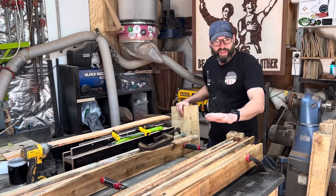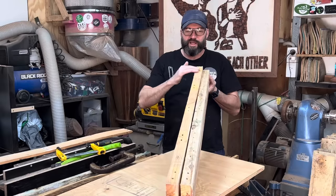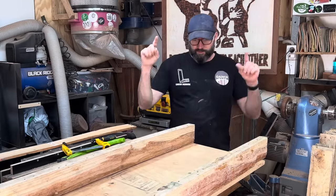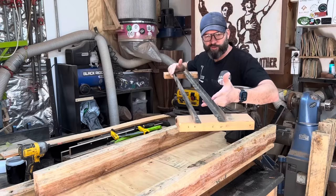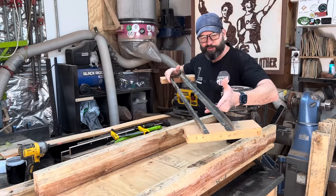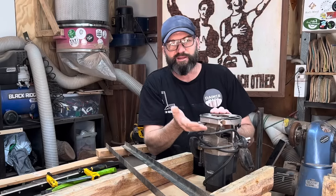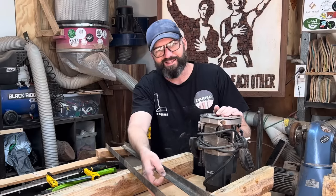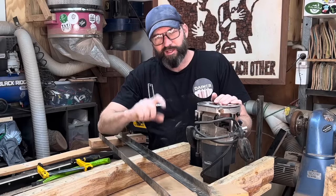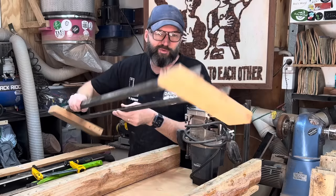To get in the game of flattening, find yourself a piece of scrap board, find a pine pallet and try to get two perfectly straight pieces. Screw those on and you've got yourself a base frame for your router sled. I made a few of these router sleds initially, but what I found is that using some angled steel keeps the profile as low as possible. Getting the depth you need to get through uneven surfaces will be one of those stumbling blocks, so reducing that thickness rather than using a thick piece of ply can save you a little bit of depth. This angled steel is very cheap from a steel store and very easy to make.